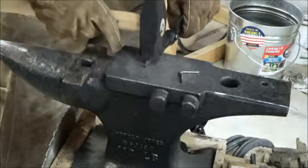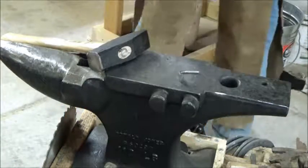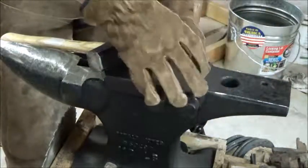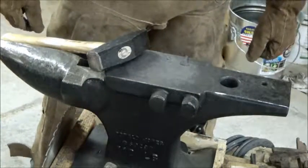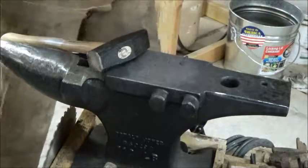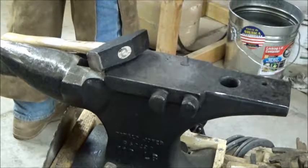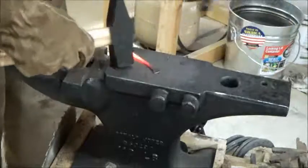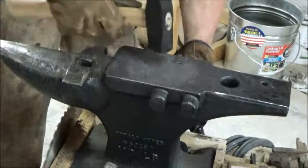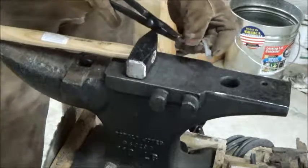I'm going to reheat this and then make the 90-degree bend. It definitely cools down quick because it's just a small piece of metal. I'm going to set this up on the edge of the anvil so I can get it very close to the other one. I kind of want the lengths to be the same, but I'm not super worried about the rest of it — I just don't want it to look like the chimp made it. We'll just lay this next to the one I've already made. These are easy — you can bend them by hand; you really don't need a hammer to put the 90 in it.